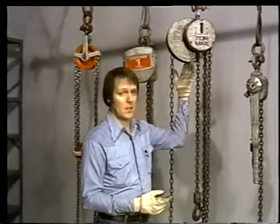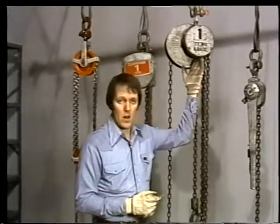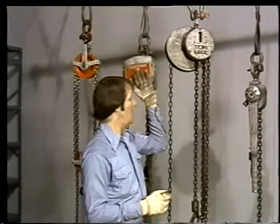With this hoist, one man should be able to lift a ton. If the hoist is overloaded, a friction clutch causes it to slip and prevents the internal parts from being damaged. With either of these hoists, spur gear or screw gear, one man should be able to lift the entire rated load. If one man can't raise the load by himself, there's something wrong.